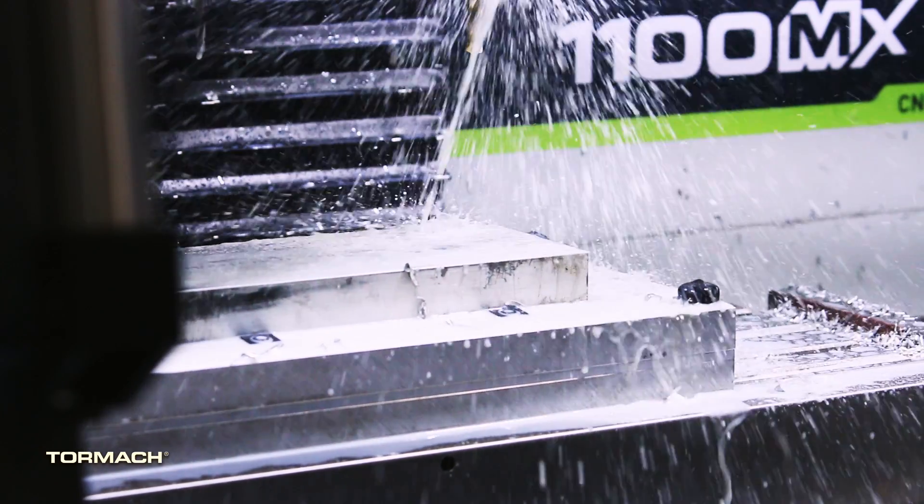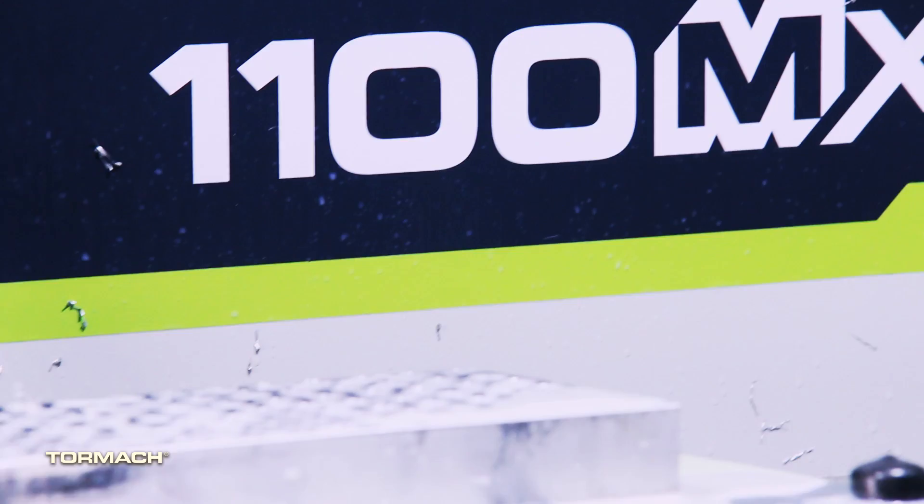The servos are also a little bit quieter, meaning it's a little bit easier when you're just jogging around. And have you seen this color? The last thing added to the hardware is an updated VFD that allows for on-the-fly mode switching, meaning you can just drop your rapid turn or your high-speed spindle in there without having to reprogram anything.